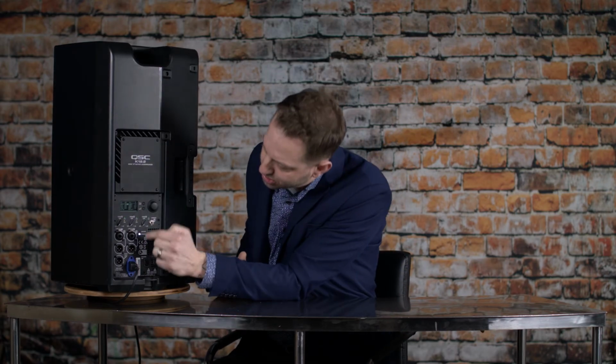It's also important to know this will set on top of the preset. So if you have a preset like dance, where it's cutting a lot of those mid frequencies, you want to make sure you don't come in and cut more. You may run into more problems as opposed to solving the problems. So it's best to leave this, again, flat or at 0 unless you feel comfortable and you know what you're wanting to accomplish there.